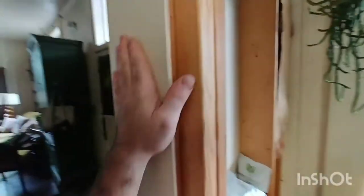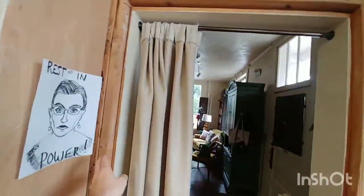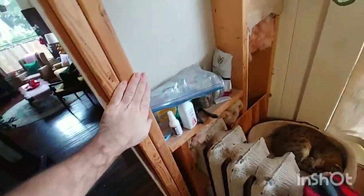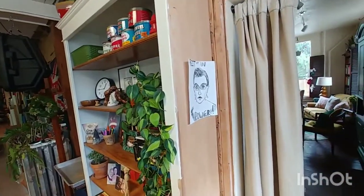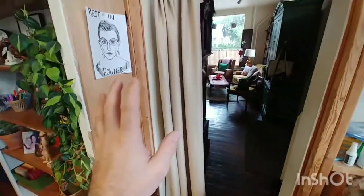The doorway wasn't here when it was a rental unit. It's a rough opening in a 2x6 wall, the 2x6 being for privacy purposes. There's two layers of drywall on that side, and there were going to be two layers on this side, but I may or may not change that. The point is, it's got a jamb in it already, even though the jamb doesn't go to the face flush the way that it should. None of this is going to stay. It needs some work, but for now, we're tired of closing it off with this curtain, basically.